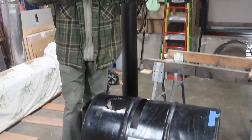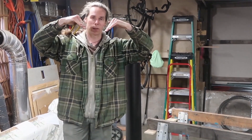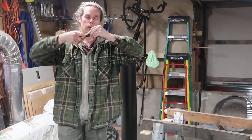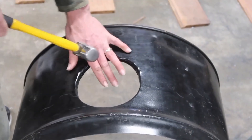I've got this part flared down but not all the way to 90 degrees yet — I've just bent most of the way. Now I'm going to come with a ball-peen hammer and start continuing to bend those to 90 degrees, and also use the ball-peen hammer to hit on this to knock it back a little bit as I expand that hole to the right size.